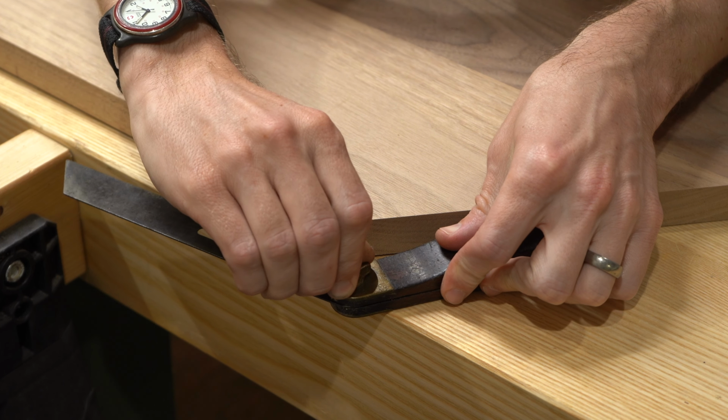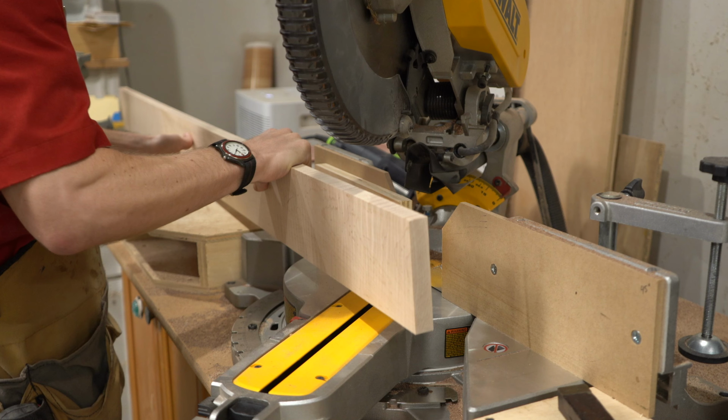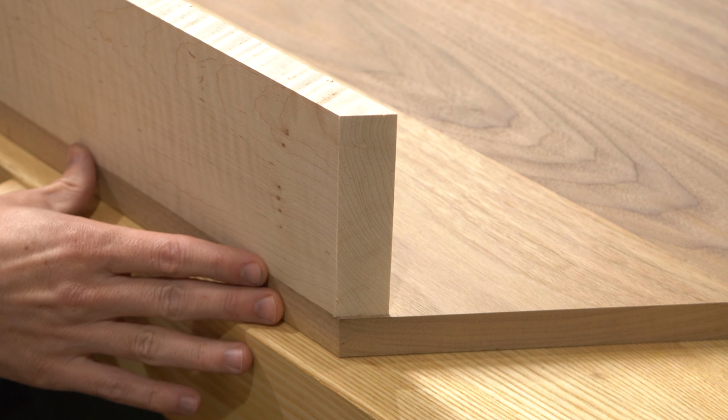When it came time to cut all the angles for the wooden shelf supports, I again worried that I would struggle to dial the angles in. But the T-bevel came to the rescue, and it was surprisingly easy to sneak up on all the angles.